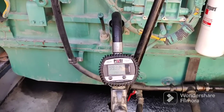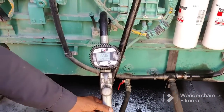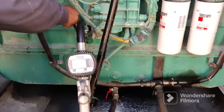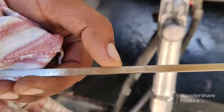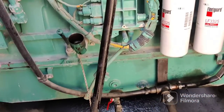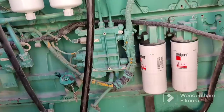The oil is coming from the service car side — 99, 100, 103 liters. It will stop. Add a little bit more because some oil will also go into the filter, so a little extra is okay. Now check the dipstick gauge — clean it first. The high level mark is reached, but a little above high level — around 2 to 3 centimeters — is fine. The oil will also go into the filter automatically. Oil change and filter change are now finished.